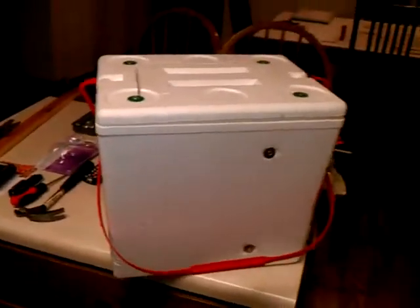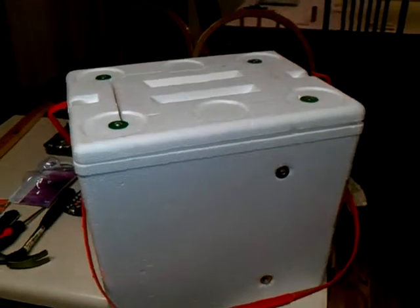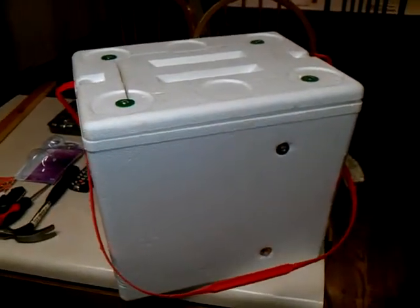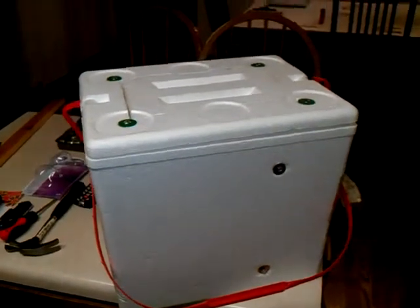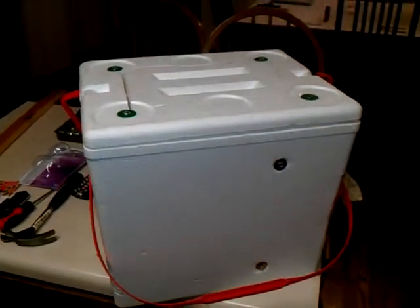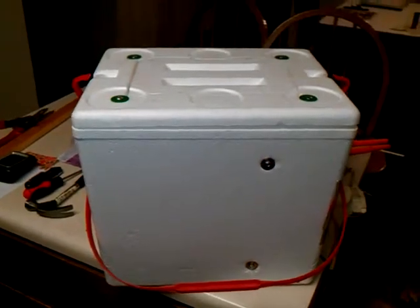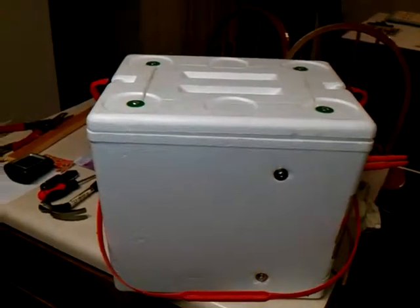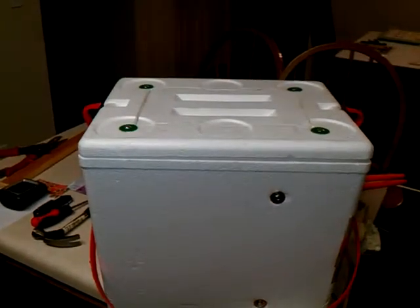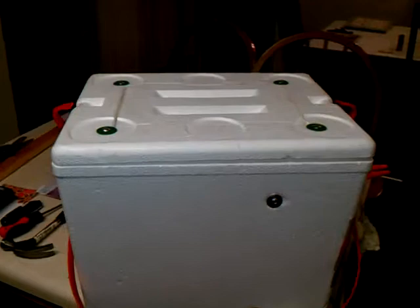Use the rusty saw blade, but then you can just put it in there like that, and then you don't have to worry. It's not cut perfect, but it's cut enough to where last night I ran it for close to, I guess, 12 hours yesterday. I just started putting the wire framing and all in there today, but I ran it last night for at least 12 hours, and it got to 102 and went to 99. So I might back off. I don't want to really back off. I'd rather, if it'll stay right at 102, I'd rather stay right there, because it goes to 102, but then in just a few minutes it's back down to somewhere around 100, and it drops to 99, and then the light comes on, it'll heat it back up, go to 102. So it's maintaining about 100 degrees all the time.